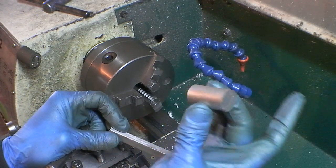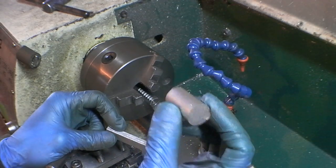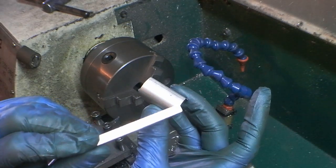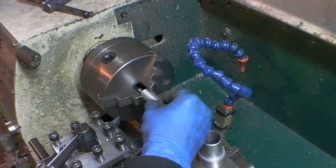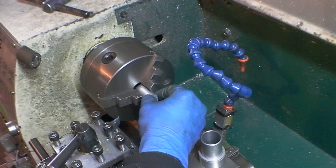This is the part I'm machining today. It's just a three quarter inch aluminum rod, and I want to machine the entire length of it, just to scrape all that ugly off. And I need a way to reliably place it into the chuck at a depth that I can do again and again.